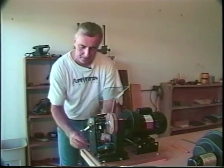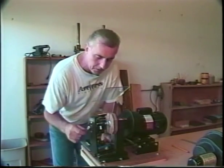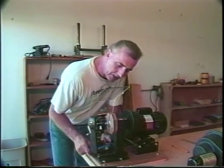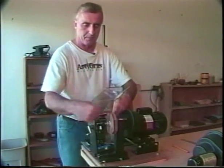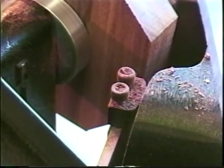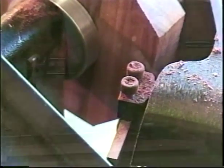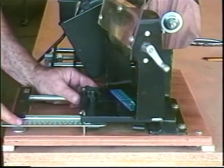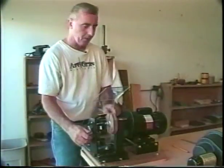This is a guide pin — lift that out so the slide plate will go forward to the point where you want to make your first cut. You go until the outside blade here, which in this case is the inside blade making the outside cut, is just beyond the stock of the wood. You find the next opening for the guide pin on the index plate to fit into, tighten up, and you're ready to make your cut.